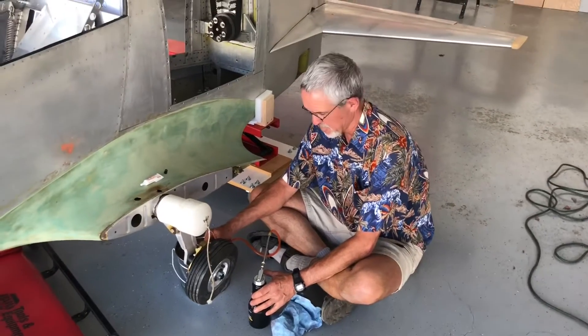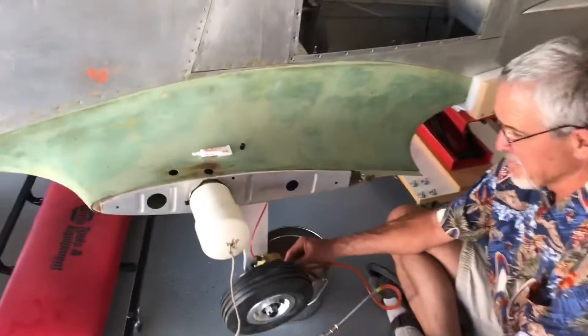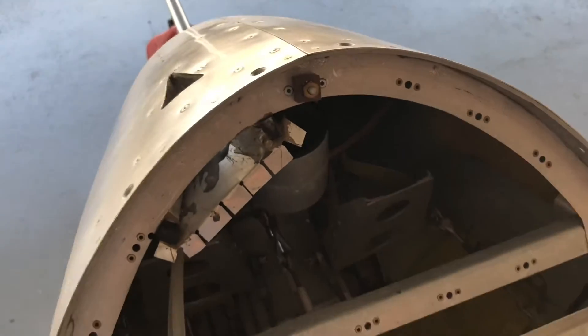Here's my cousin Galen, the only other person to have logged nearly as much time as I did in the Falcon XP back in the 80s, and he's a master mechanic. You can watch the brake fluid coming up through that line — we should see some coming up into the master cylinder. It's going to be hard to see from here, but you'll see it starting to fill with bubbles in the reservoir. There goes — we saw the brake fluid come up, and now it's filling. We're watching for bubbles, and as soon as it's clear we have a successful system.